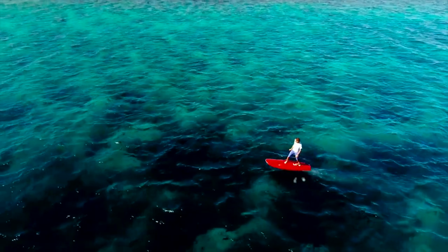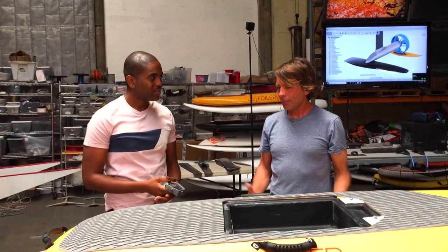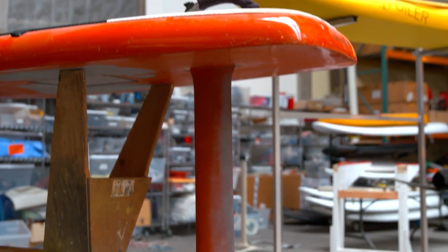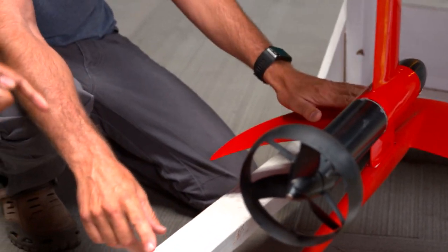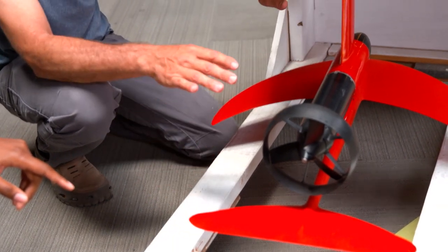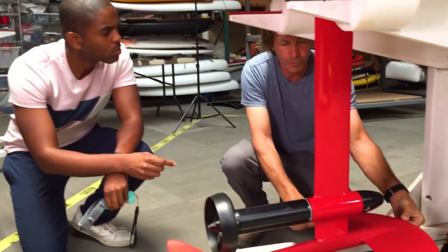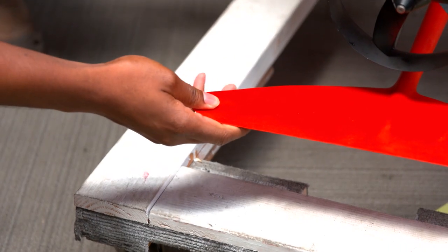The Jetfoiler is definitely a watercraft, but it uses the principles of aerodynamics as well. Foiling is flying above the water. The different projects we work on all have a hydrofoil underneath, which is basically an airplane — an underwater wing that lifts you and the board out of the water. The back wing is actually pulling down, which causes the front wing to go up, very similar to an airplane. There's enough flow over this to create lift, and the wing itself is also profiled just like an airplane, with a round surface on top and a concave surface on the bottom.